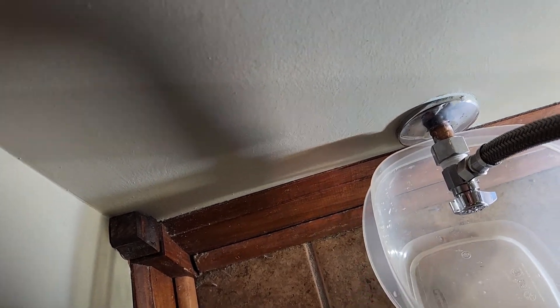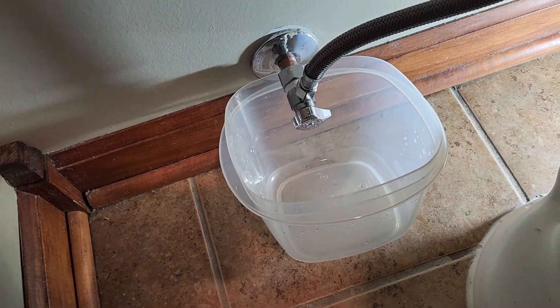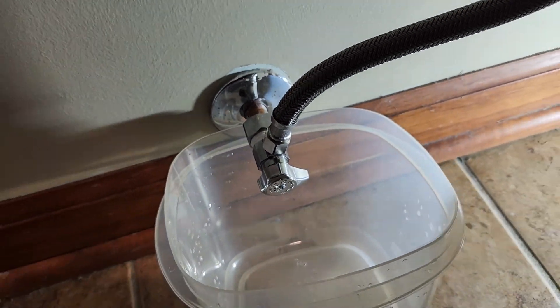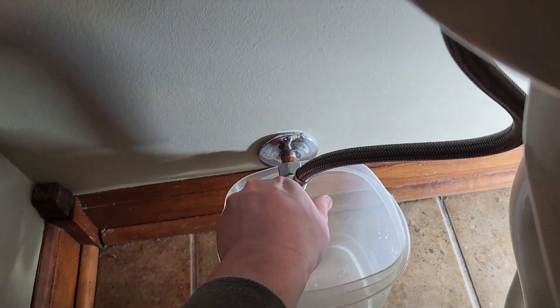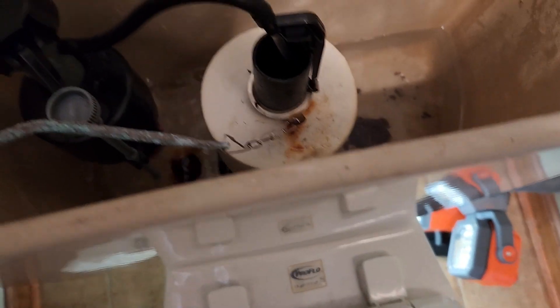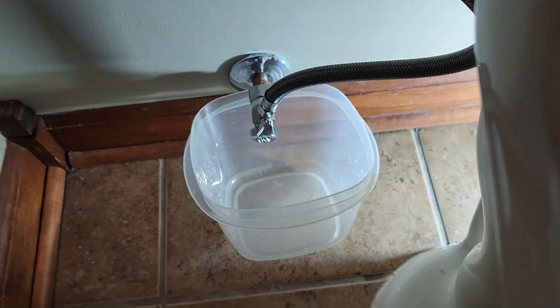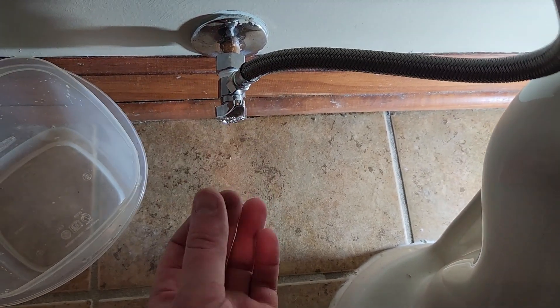Always go ahead and put your finger behind that fitting to make sure it's dry. I will usually keep a Tupperware for a day or two under a job like this to make sure we are not leaking — if we are, you're able to easily tell. Keep it under surveillance for a day or two. Don't put your tools away because then it will definitely leak. Turn our water back on, make sure we don't have any additional drips and that we are filling correctly up here. I think we've got no drips — we are dry.